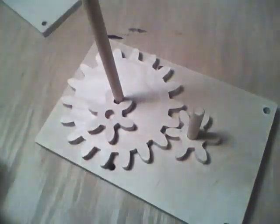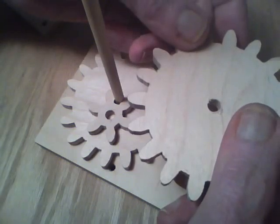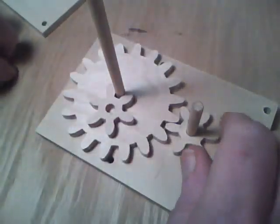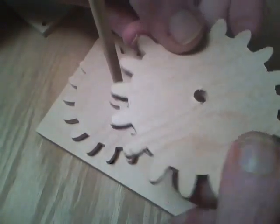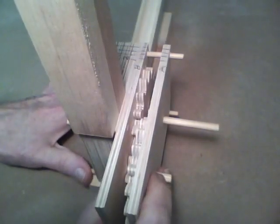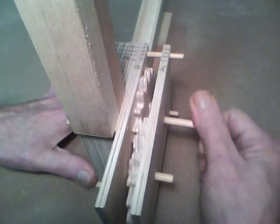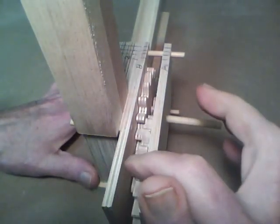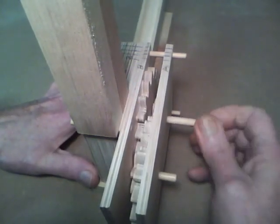This little one will go on here and then the bigger one will go on here. These two here will be glued together, and then the input gear is here, and these will be allowed to rotate independently. Now I've got it semi put together. If I turn this small gear here on the right, it's turning this larger gear. These two here are connected and glued together, then this one will drive this big one and thus turning the shaft.